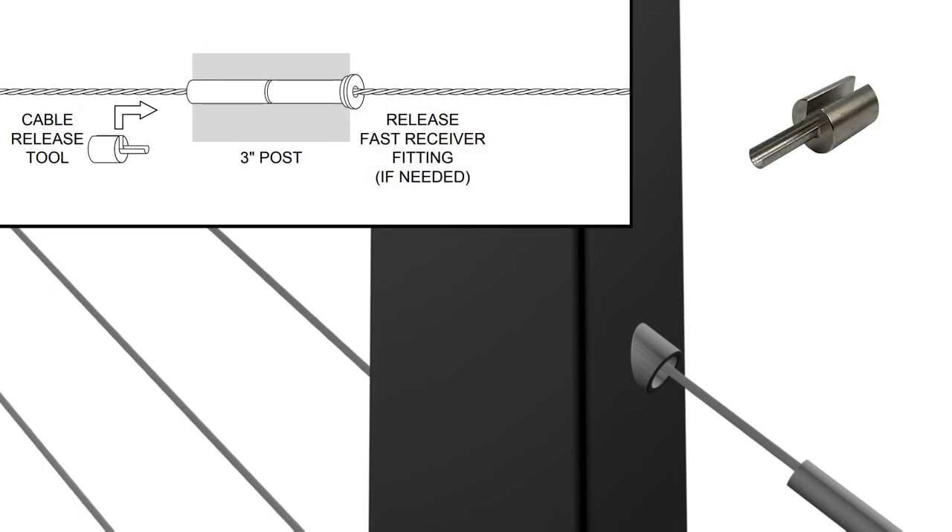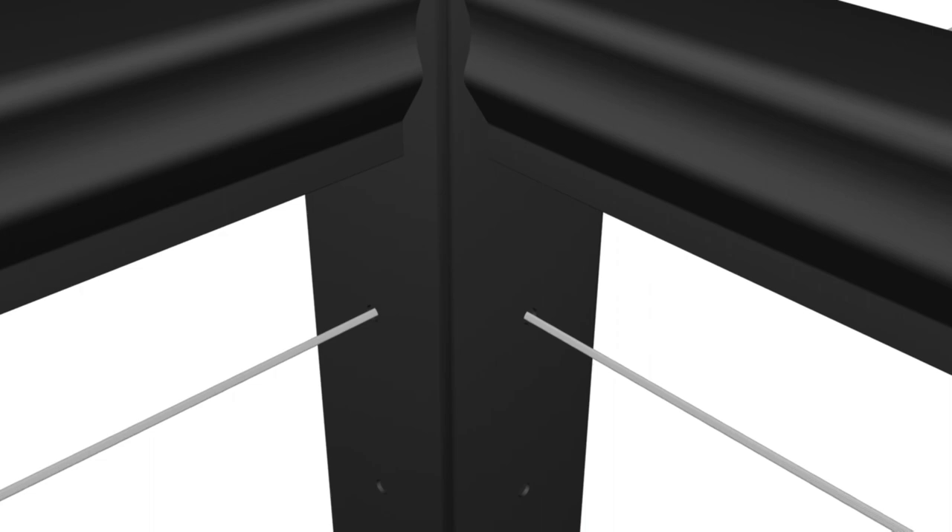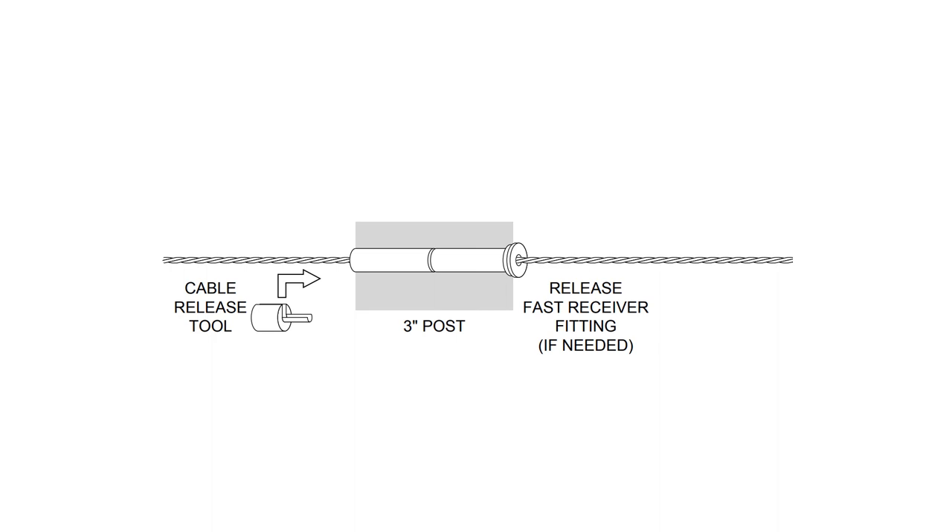Alignment plugs are installed in 90-degree posts to keep insert holes aligned — do not remove plugs until cables are installed into empty holes. Important: For the bottom of stair runs, beveled washers must be installed to align fast receiver fittings with pre-drilled holes in the post. It is normal to have trouble inserting the cable into some fittings if the locking mechanism is already locked. To free it up, insert a cable release tool or other tool with 1/8 inch or smaller diameter; larger tools may get locked in the fitting. Push the fast receiver fitting firmly into the hole in your post. While holding the receiver against the end post, pull the bare end of the cable to remove as much slack as possible. Inspect to ensure there is no slack along the whole length of the wire, especially around corners. If you need to remove a cable from the fast receiver fitting, slide a cable release tool onto the cable and push firmly into the fitting to release the mechanism.